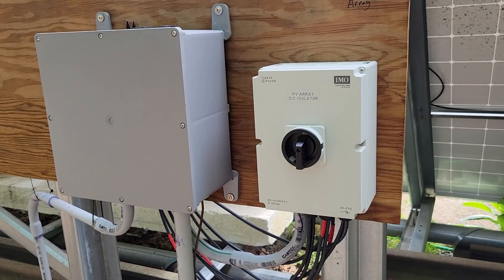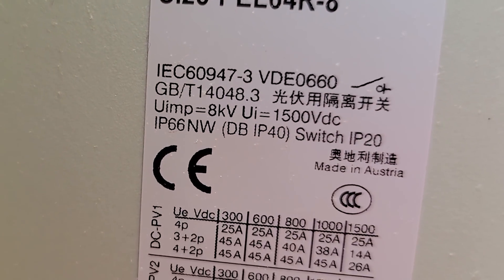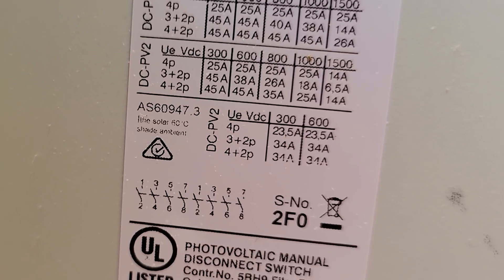On the back of the array I'm wiring in an IMO brand disconnect switch, which can handle very high PV voltage. Paying attention to DC voltage is critical — when you switch it off you don't want an electric arc inside the disconnect or it will burn out the contacts. The IMO switch uses a cam action and spring-loaded mechanism: you turn, turn, turn and then snap — it quickly opens or closes. Note that this IMO PV disconnect is not a fuse and not a circuit breaker — it is purely a disconnect, not an overcurrent protection device.